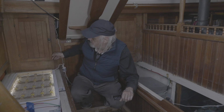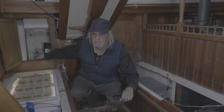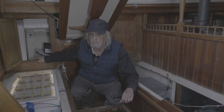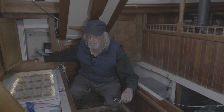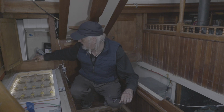I got a 5,000 watt inverter in here that I haven't hooked up yet, and it's a pure sine wave inverter, and it's going to be maybe installed in here. I'm not sure yet, but I'm going to have to create really good ventilation because these things get hot. But they need to be as close to the battery bank as possible. So this is one option.